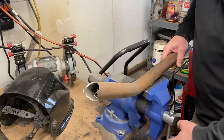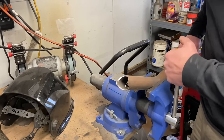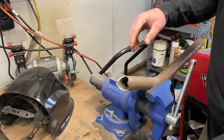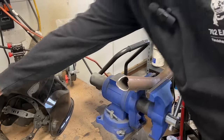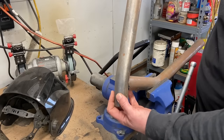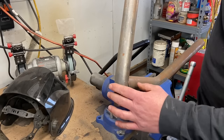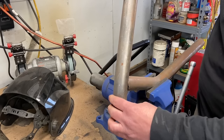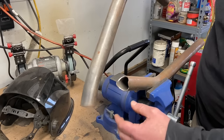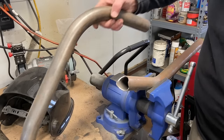You'll want to get a vice and a couple of pieces of scrap tubing. Everything we're welding is going to be fish mouth — these are cut in a fish mouth — and basically I'm going to use these two tubes, tack it, and then weld it. That's practice. I can pull it off and keep running up and down this tube — I can get my cutoff wheel, cut the welds loose, re-weld it, and keep trying.